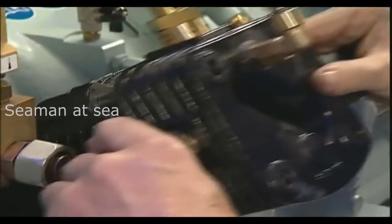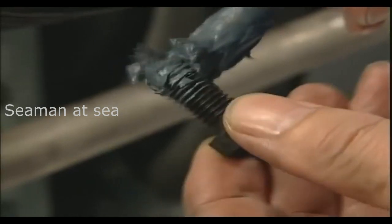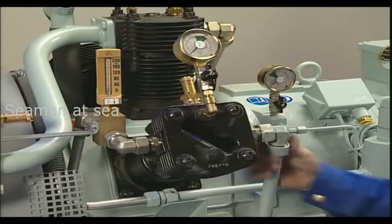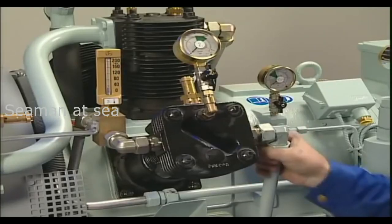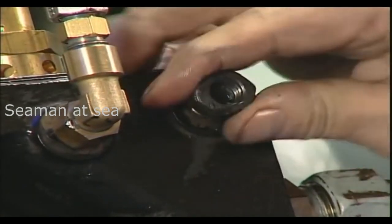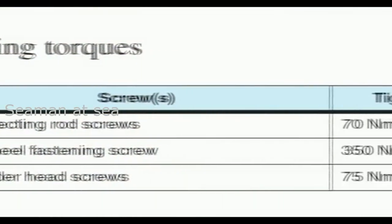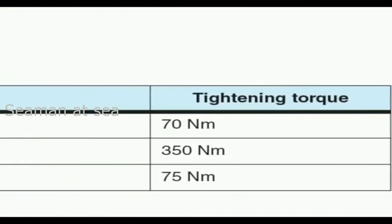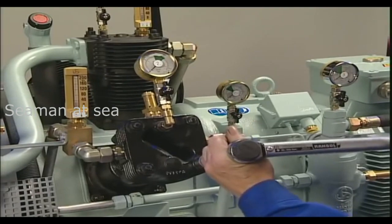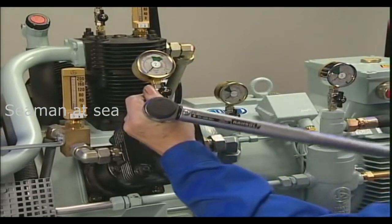Oil or a hot screw paste on the screw thread will make reassembly easier. When all gaskets and discs have been inserted and all screws tightened hand-tight, the cylinder head screws are firmly tightened to 75 Nm according to Table Tightening Torques Chapter 8.4. The check for the valves is then complete.